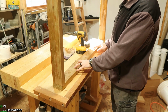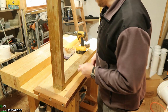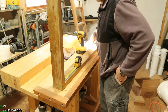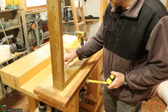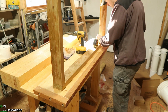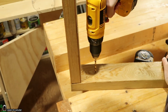I've got the 44-inch piece down here with the 2 32.5-inch pieces going up. And to attach this to the building, I have got these big old lag screws, and I want to come out 2.5 inches from this piece so that I can hit the studs. I've got the double stud alongside my door going all the way up, and that's where I'm going to be installing these. And then I'm going to use a number of just 3.5-inch screws to make sure this is firmly attached to the building. But with these big lag screws, I'm going to go ahead and pre-drill a hole because I'm afraid that thing would split the wood pretty good.